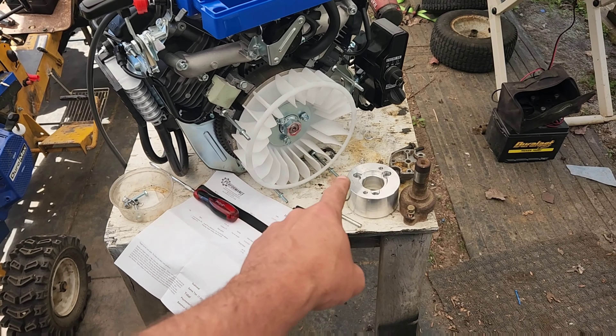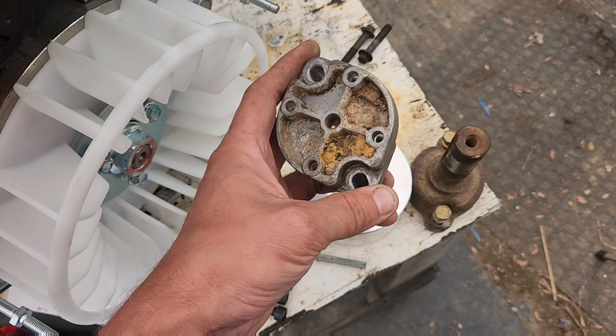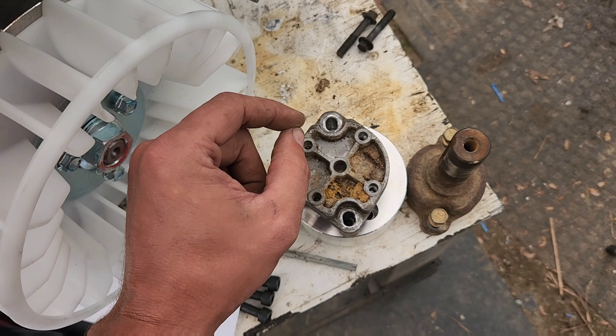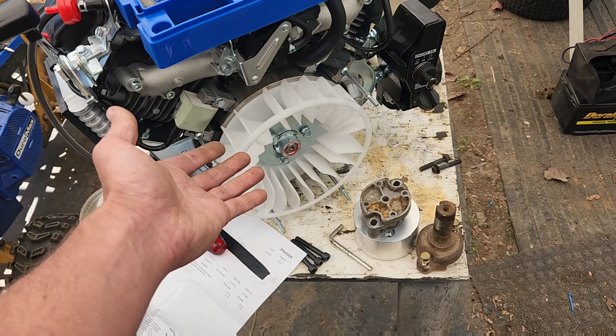This is the adapter that a Cub Cadet uses to hook up the shaft drive to the flywheel side. There's a quibble with this, but it's all fixable with a little bit of grinding. On a Kohler, these are spaced just a tiny bit further apart and they use a different thread type. So if we get in there with a rat file and clean that up just a little bit, we can make that line up, get a couple of coarse threads, pop the coarse threads in there, and we should be good to go. The next question is, is it going to fit? We're going to do this for you guys.